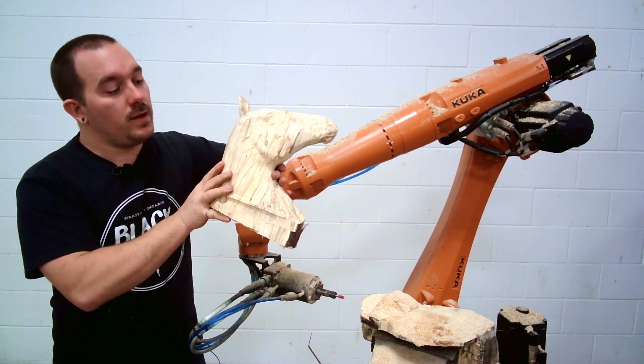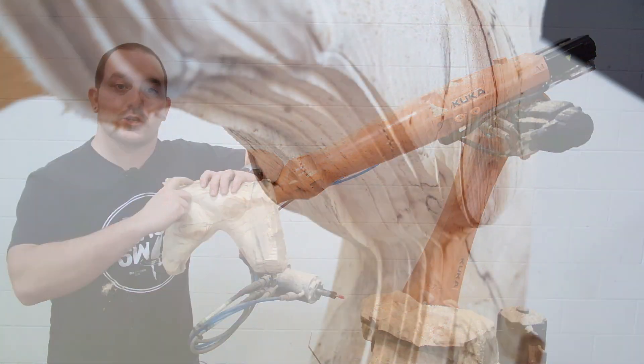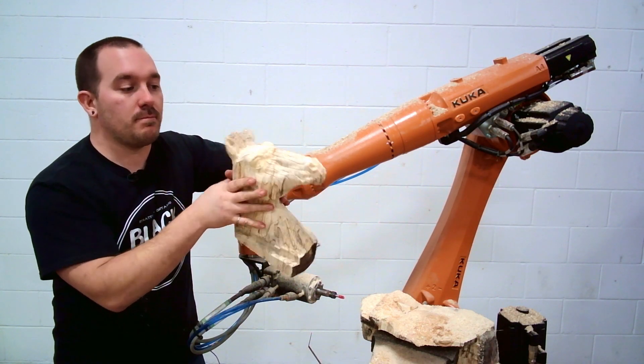This is turning out really well so far — this side looks awesome, this side not so much. When I was programming it I told it I had used a quarter inch tool, but when I bought my tool I used a three-quarter inch and I forgot to update the roughing pass on this side. Because of that it took away too much material and the finishing pass couldn't make it look nice. Three days later, I'm back in the home shop now. Past Dave wanted to just leave this and hope no one noticed the back of it. I'm older and wiser now, so I went back, fixed my program, and recut the whole thing from scratch. Unfortunately my log was just a little too small so there's some spots where you can see the edge of the log, but I think that's going to add a little character so I'm going to leave it. I'm going to use some sandpaper and a Dremel to clean the whole thing up.